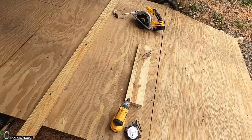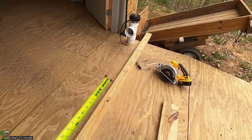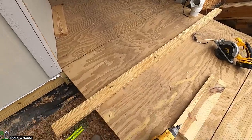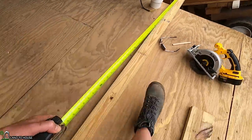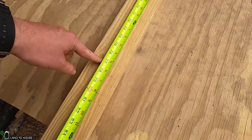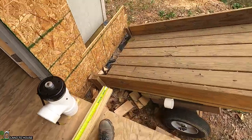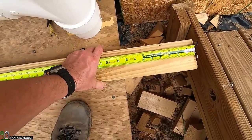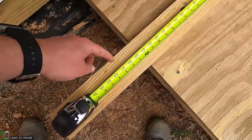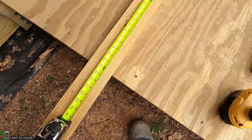So what we basically need is to measure out - 78 inches would have gotten us all the way across the rock. So I want to have another eight or so inches over there and then this is going to just drop down. That's just about enough board. So that's eight foot. We want to have 77 as our minimum number just to get across there. I think that's a five and a half. Let's just do eight there - so that'll be eight inches across. Let's cut this at 86 inches. That piece right there can be used to tilt down into it. 86 it is.